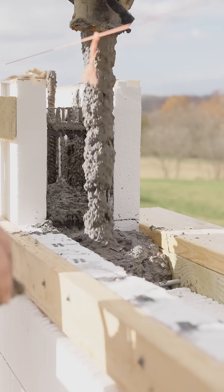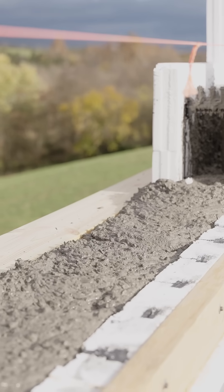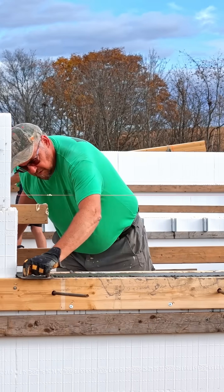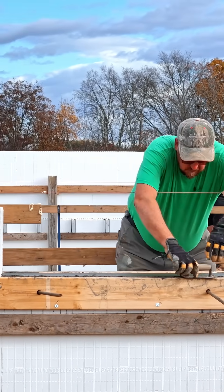When you are ready to pour the walls of your project, especially if you're doing it yourself, you need to schedule out ahead at least a week to two weeks with a local ready mix concrete company and a boom pump company. They need to work together — they need to be on the same day and available at the same time of day for the pour to be successful.